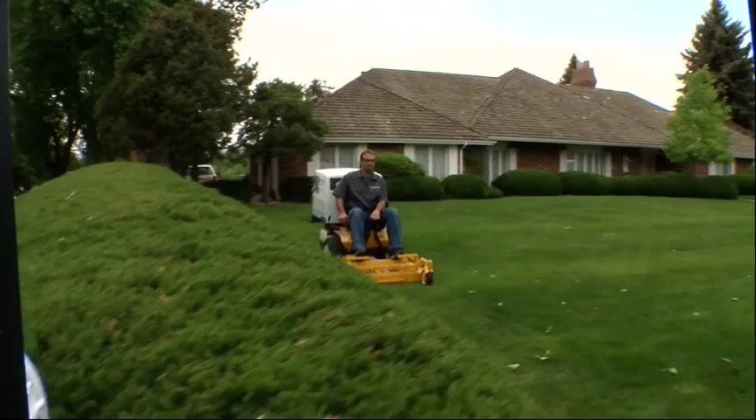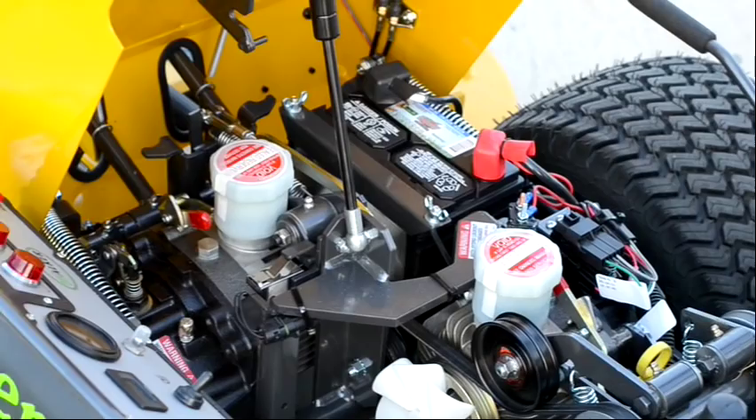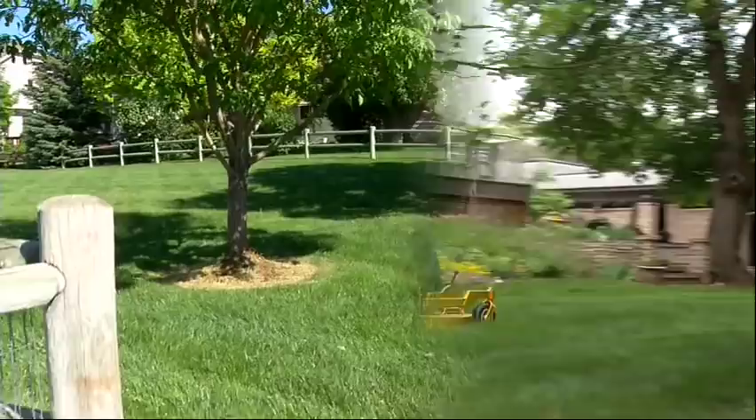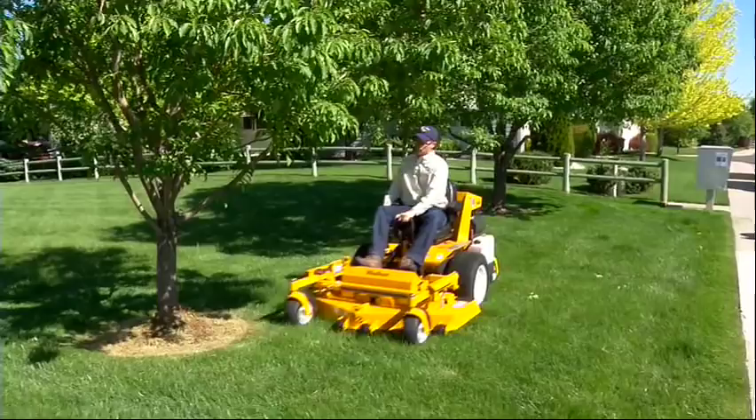The agility of the Walker, like the out-front deck, was truly designed and built into the mower. Two hydro-axle units, one for each main wheel, are mounted in the chassis, providing independent wheel drive. Walker's clean and simple axle design not only makes the machine maneuverable, it also eliminates the maintenance of chain drives, the bulkiness of some transaxles, and the complexity of hydraulic wheel motors found on other zero-turn mowers.